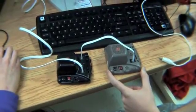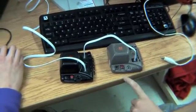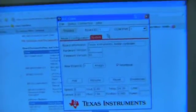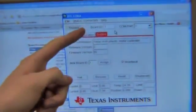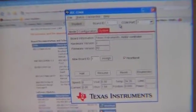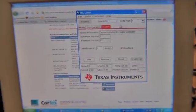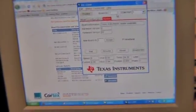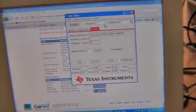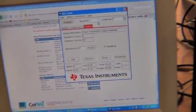The brown Jaguars can be updated by linking them in series with the black Jaguar when they already have a board ID. You can select what board ID you wish to update from the box in the top labeled board ID. You would click on this board ID selector and from the dropdown be able to select between the different IDs. Then just go to File, Update Firmware and select the plain old Jaguar firmware rather than the black Jaguar firmware, and hit update.